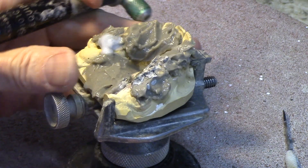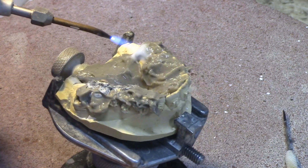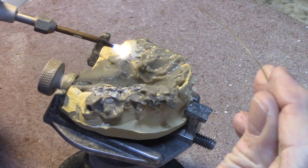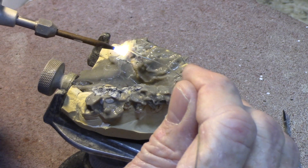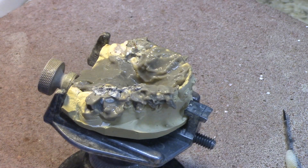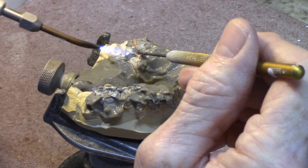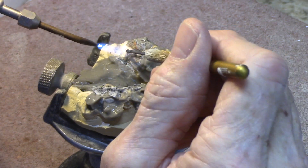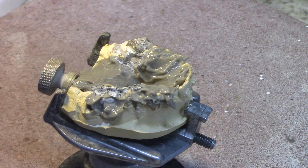Let's go over to the other side — I'm going to try to keep my hand out of the way so you can see what's going on. Once again, heating up the flux. The freestanding wires are going to get hot first, so I'll have the solder ready to go on those as soon as it's ready. Then I take my probe, melt the solder, and move it around, completely covering everything and making a nice broad surface.